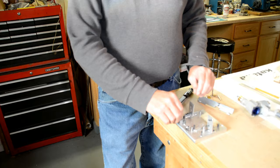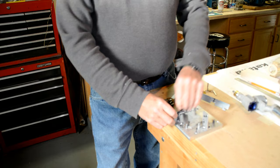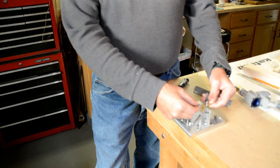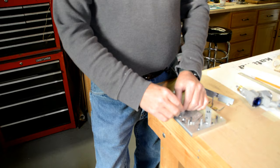And then this little jig I made for two or three different sizes of bell cranks. You'll have different widths, from fuselage widths at the stab, or fuselage width at the main wing. And it's just a piece of aluminum. This piece holds your upright, which bolts in place onto this piece, and that's bolted down tight. And then these dowels set your width, your fuselage width, which you can make whatever you want. As plans changed, I've changed this. I'll probably end up getting another piece of aluminum sometime down the line.